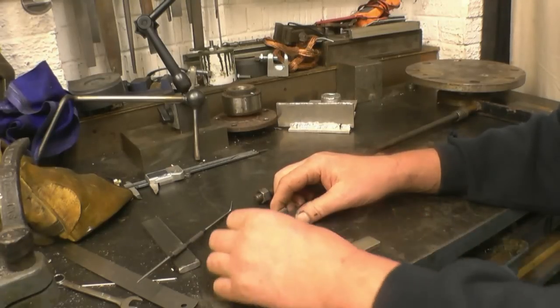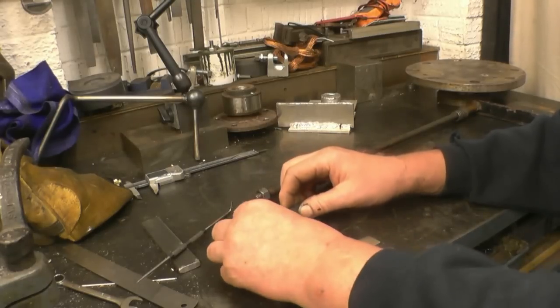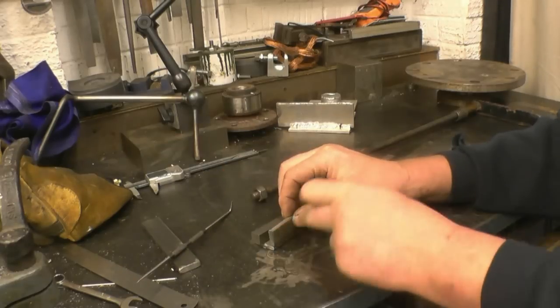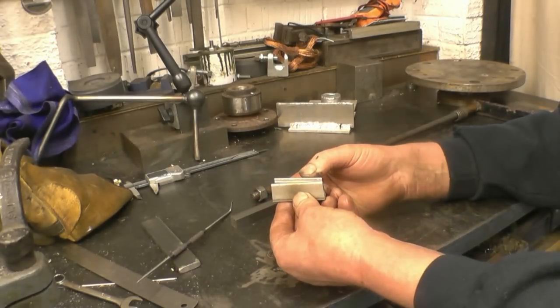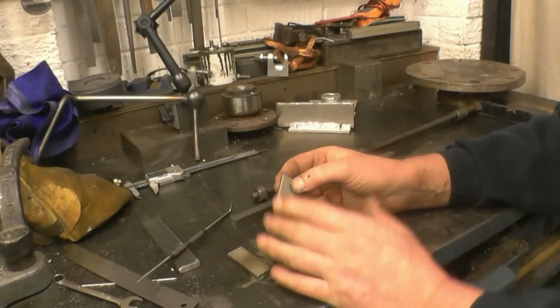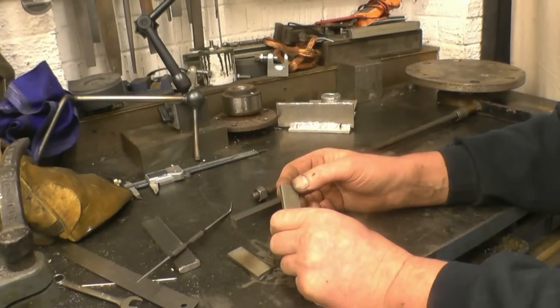The first thing I need to do is mark off what we're going to cut. I'm going to use one like that, one like that, one to that side, then cut off and I'll end up with an outside corner joint where I can put a nice fillet TIG weld. I'll get these marked off, nip up to the other shop and cut them off quickly with a slitting saw, and then we'll go from there.